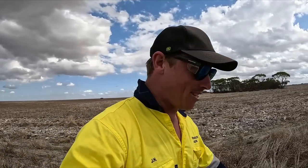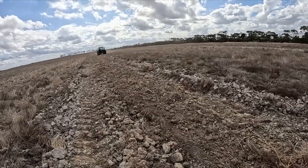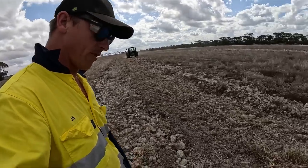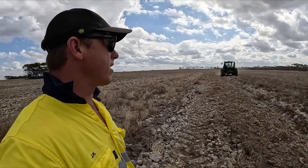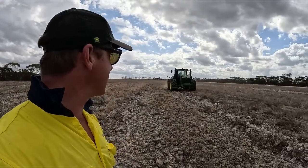That's not doing the job, is it? The issue is that the ruts are obviously sunken deep on each side. It's a lot better now, but it's meaning that the drag is floating, if you will, and it's not getting the stuff that it needs to get. We'll see what this looks like when it goes past here, and yeah, it might need to increase the speed, but you can see it's a bit bouncy in there.